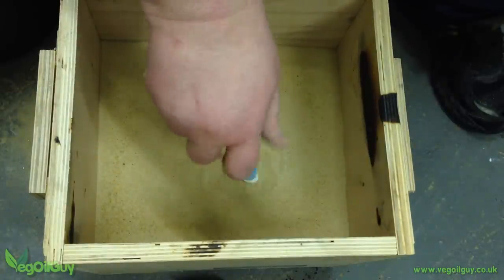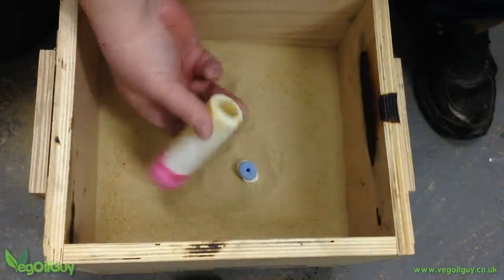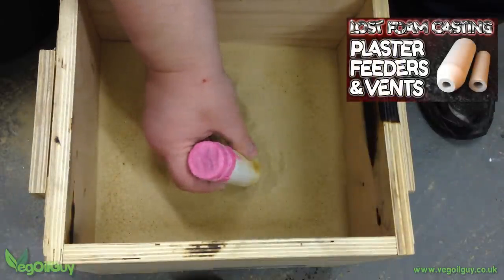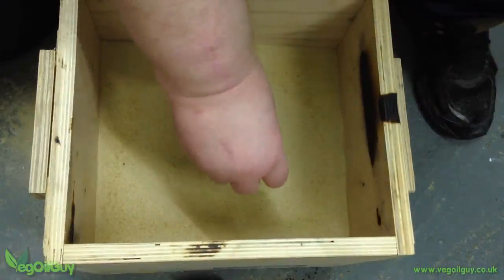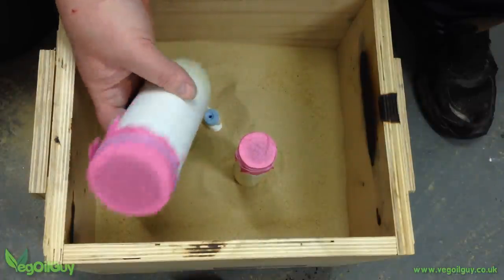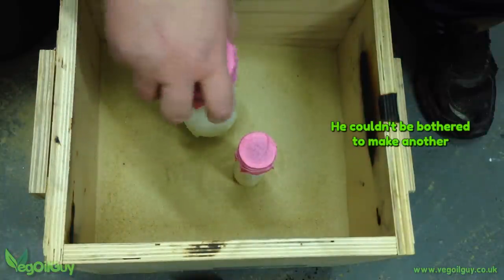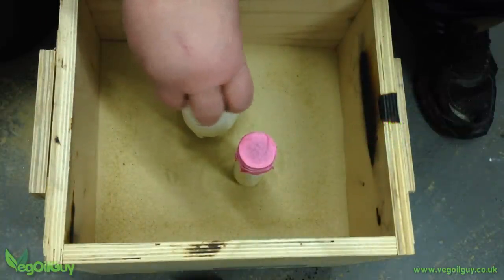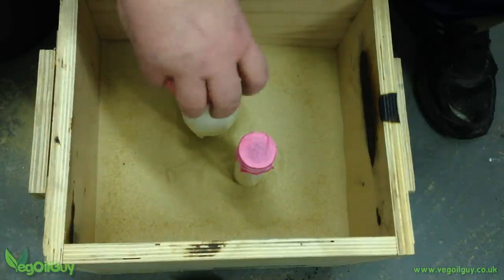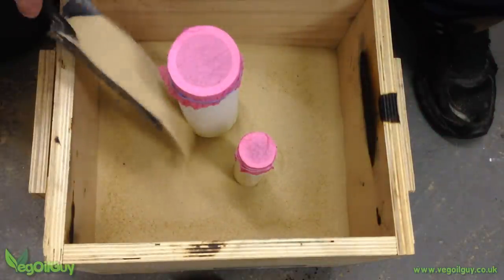From there I removed the screws and the string. Here's my plaster vent, and it fits neatly on top of the foam gate with just a gentle push — it has a paper cover at the moment to keep out any sand. And here's the plaster feeder. If you're wondering why there's tape around the bottom of this, it's actually broken — I dropped it and cracked it — but that won't stop it from working. The tape and the sand will hold it together and it will still contain the molten metal. I also added a strip of tape around the top of the feeder, just in case I knock it.